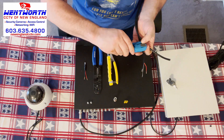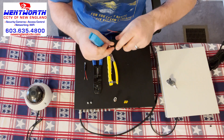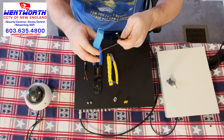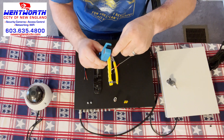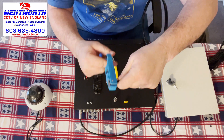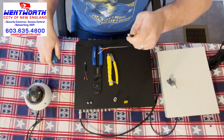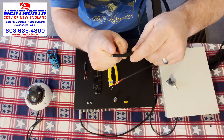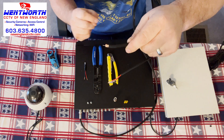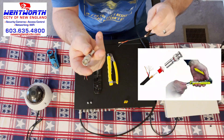This tool is a coaxial stripping tool. We are going to take the solid copper wire that's going to plug into the BNC connector and put this into our stripper just like so. We're going to turn it this way and pull it off. As you can see, it stripped the jacket off of the wire and made it the exact same length for the ideal RG59 compression fit.